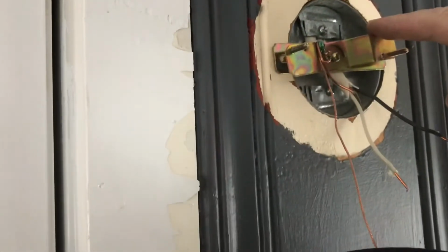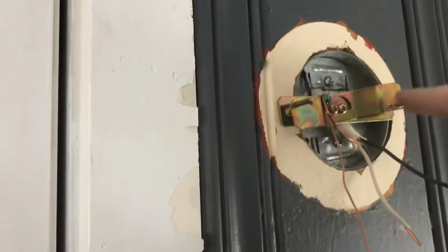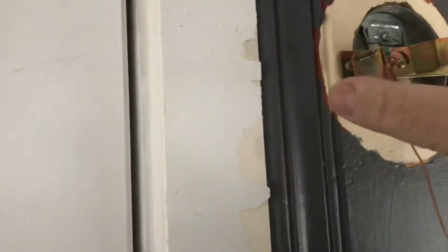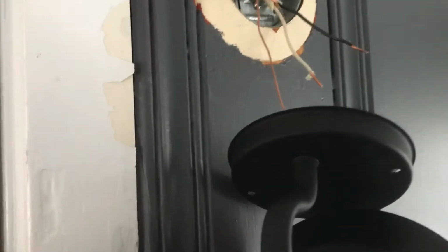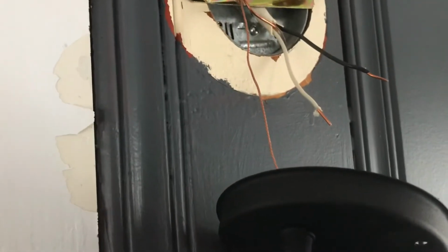The new plate on. Remember, these are off. So if you put this straight across, these are kind of crooked. They're not straight. So you got to make sure you position that lamp on there first. Make sure it's nice and straight. Then you tighten down these screws here. The other thing is when you're working alone with fixtures and you can't really do everything with 2 hands, hook your ground wire up and it can hang while you do your connections.